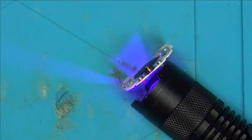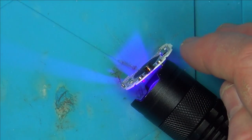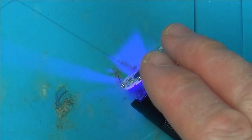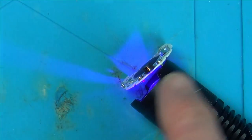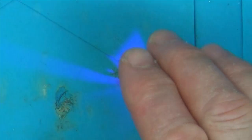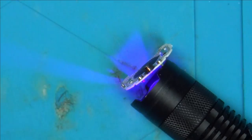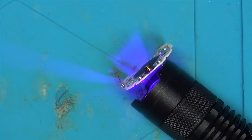So I've just got the UV light on this trying to set the solder mask. I've run a couple of runs of tiny wire — one to get the light working and another to come up to this point here, and I had continuity there which is good. But I also needed to branch off to that little wire and couldn't solder in there because it's just kind of gold conductive paint. So I put a blob of solder on the wire, then silver conductive paint on top, then put the blob in the conductive paint and applied heat to make it go off quicker. When I tested for continuity it was there. I've put solder mask on it to keep it all in place.